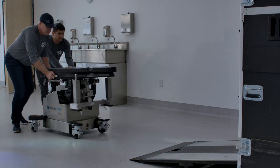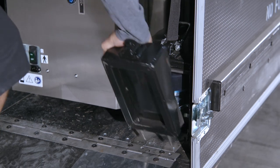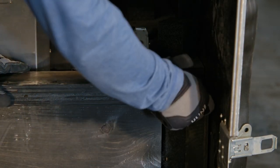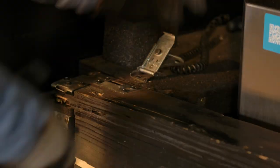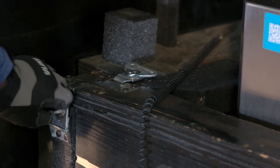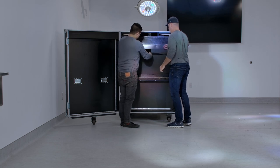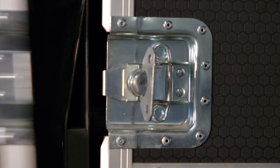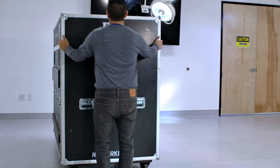As the table is very heavy, ensure the wheel chocks have been placed behind the wheels of the crate prior to loading the table. Note that some crates will have a table lock that slides beneath the table to lock it in place. Latch the bottom and top of the table block, then take the pin and insert it into the hole at the bottom of the crate. Repeat the same steps on the other side. After the table is secure, lift the ramp up and attach the strap to the front of the ramp. Close the crate door and place the wheel chocks back in the bottom back door of the crate. If there are multiple tables and crates, make sure to put the correct table and blue bins back in the correct crate. Now the crate is ready to load on the truck.